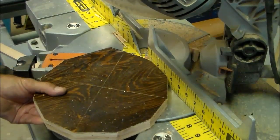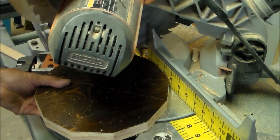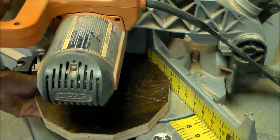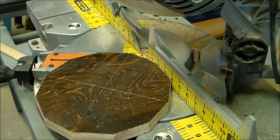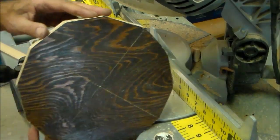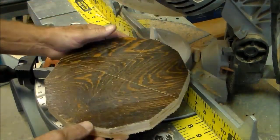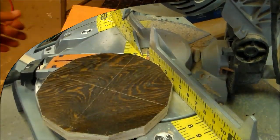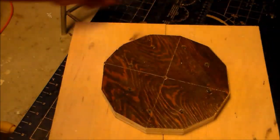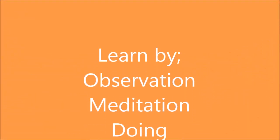The finished hub will have 12 flat surfaces measuring approximately two and a half inches across — this is the width of your spokes that will terminate there. The hub then has to be fastened onto a backboard, which is what the spokes will be nailed to. My finished hub measures nine and three-sixteenth inches flat to flat. Here is the finished hub on its backboard. Thanks for watching, friends.